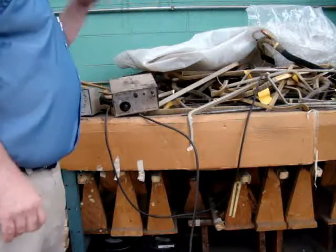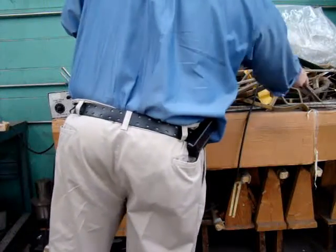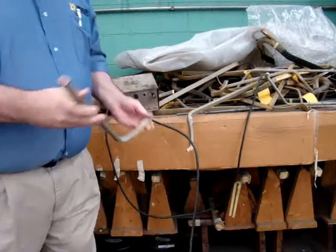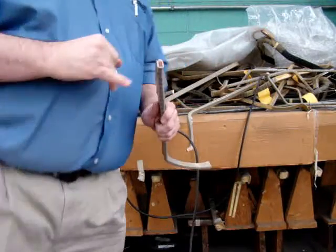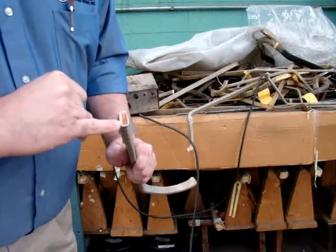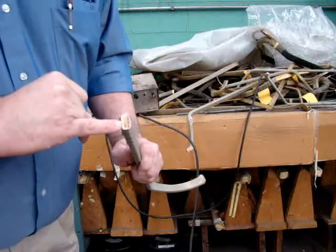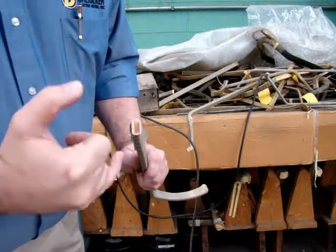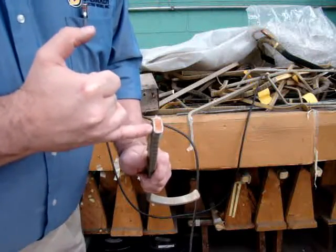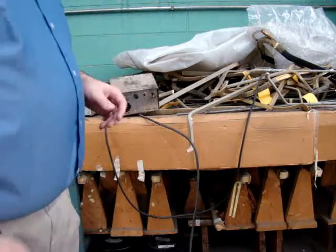The type that we're looking at in 500 is similar to this coil here, where I have wire on top of wire. We already have the data on that GE, so we know the conductors are a little bit larger. This is not rectangular — it's more ribbon wire. In order to simulate a short, we drilled in the top of the coil and then about where the next turn was going to be, so that would simulate a direct turn-to-turn short.